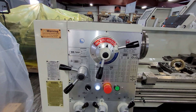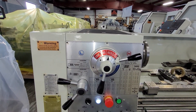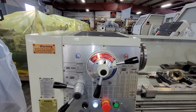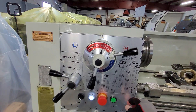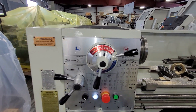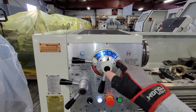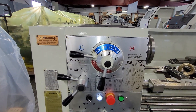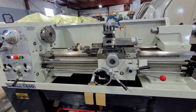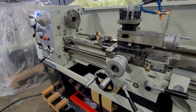For changing the different spindle speeds on the lathe, you have two main gear ranges — high and low. When you're on the high side, these are your four different RPMs that you can run. Now we're set up for 455. You can see we'll push the jog button — that's your 455. For changing speeds, now you'd be on 70. These are all your ranges for low: 70, 140, 335, and 220. We've increased the RPM speed a little bit, so this will show a little better — we're at 220 now.